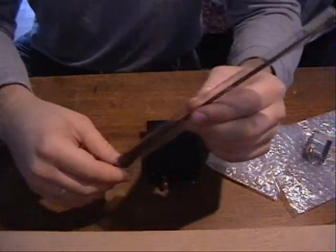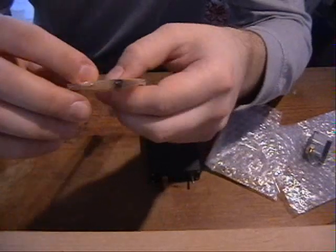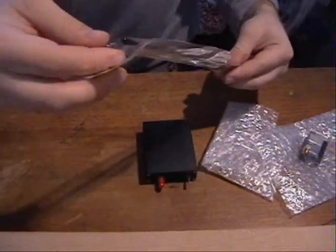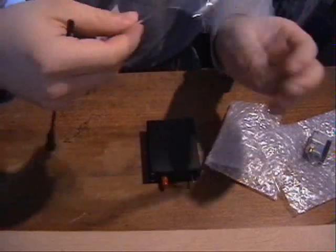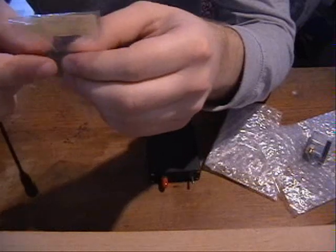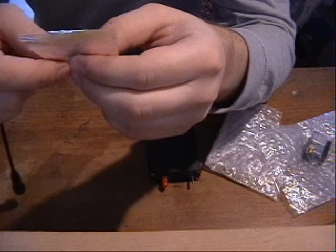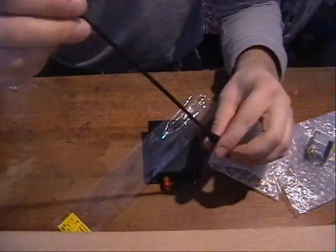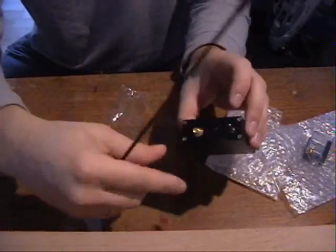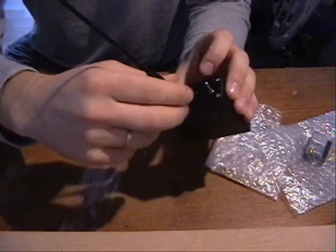And here we have the antenna — the stock antenna which came with the other parts of the package. It's the normal antenna offered by SIT. It's 3 decibels and 433 megahertz plus or minus 8 megahertz, and it's 50 ohms. The connector is SMA-J — pretty flexible, a normal antenna. Here you can see the connector, and it fits the transmitter just like it should.